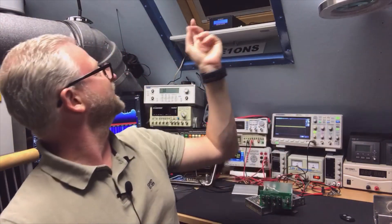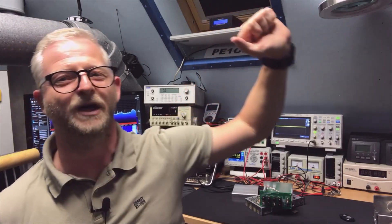How does it work? They have this temperature controlled oscillator which is already almost spot-on, but they use the GPS signal — they connect that to a processor. GPS has a very accurate time system, synced by atomic clocks, so it's super precise. What they do is count pulses for an hour and compare that to the pulses of the oscillator. If there is a difference they compensate the oscillator a little bit. If you just switch it on it will first be a little too high, then a little too low, and then slowly over time it will flatten out — that's what you saw.